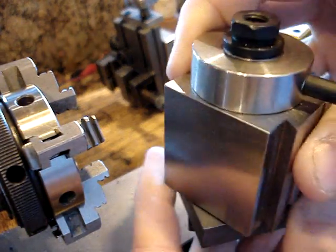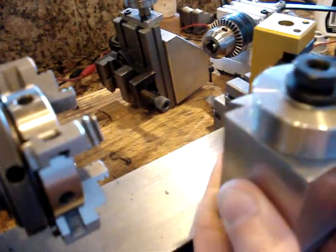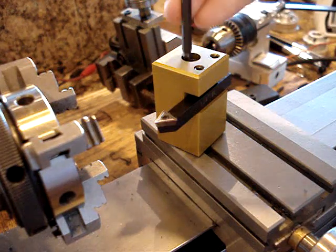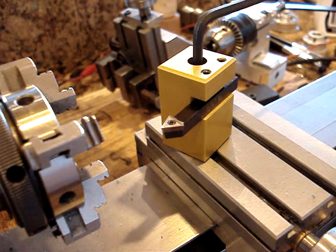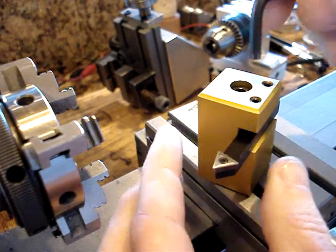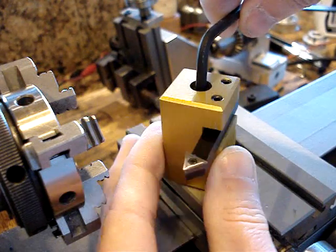It's very nicely built — I showed it to you in another video — super high quality, cam operated. But when you really get right down to it, it's constantly in the way. What a lot of people do is take this screw and make a little handle: instead of an Allen wrench, they make one long threaded screw and bend it over into a handle, which is apparently very popular in England when it comes to lathes. You just cinch it down, use the little handle to adjust, and cinch it down again.